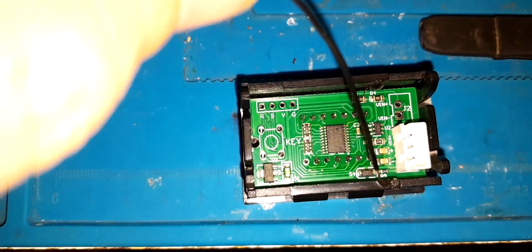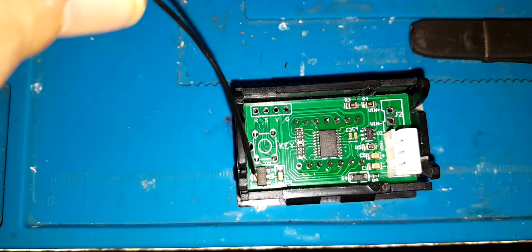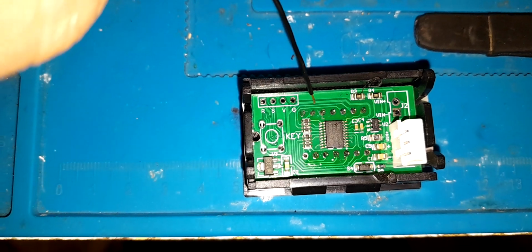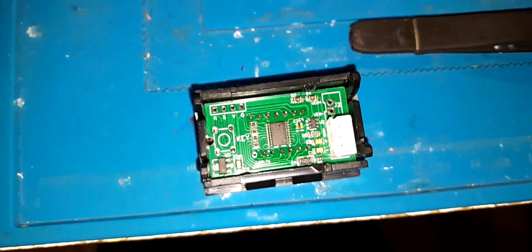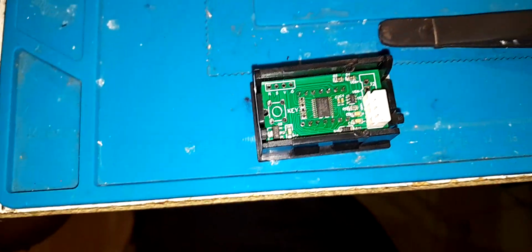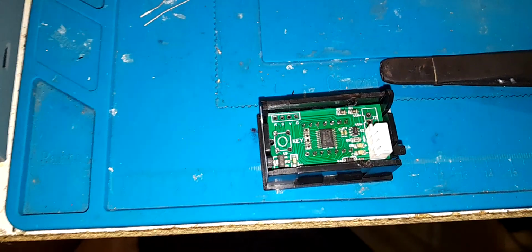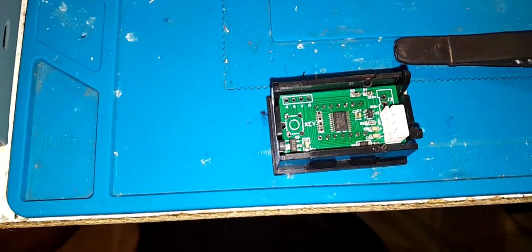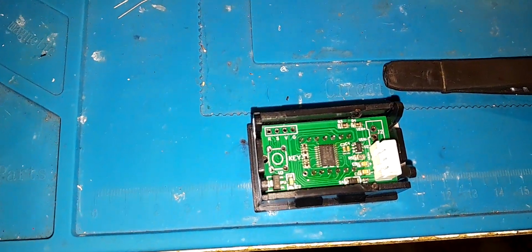The line in question was this resistor, this diode, going into this regulator, and this capacitor on the output coming out over here. So anyway, I'm going to have a look into that circuit and see what it's doing, and then fix it. But yeah, I don't know if it's like you use it with long wires or too high an impedance on the input or something on the voltage supply to it, or what it is that causes this condition.